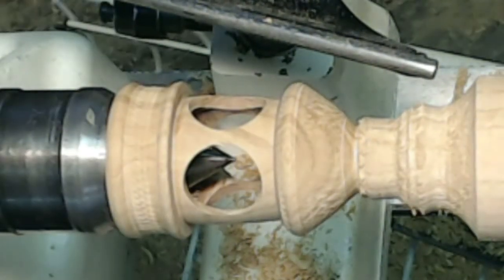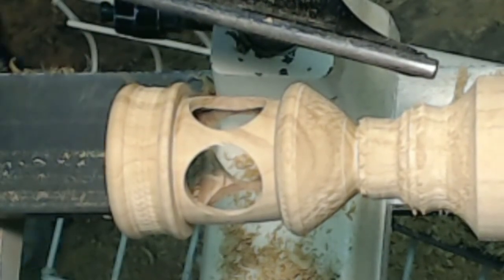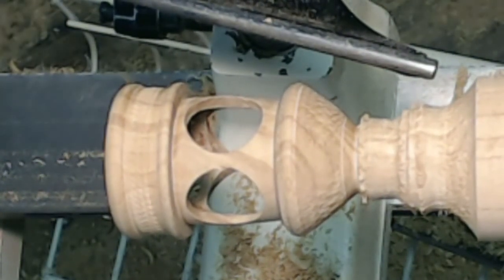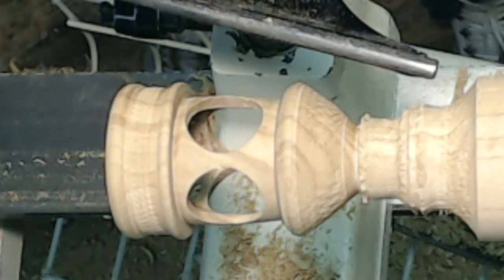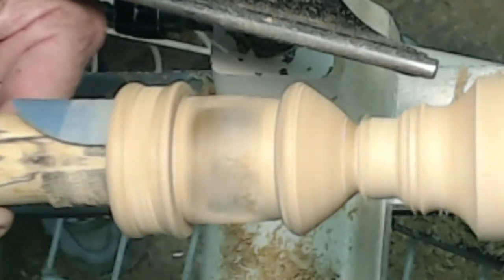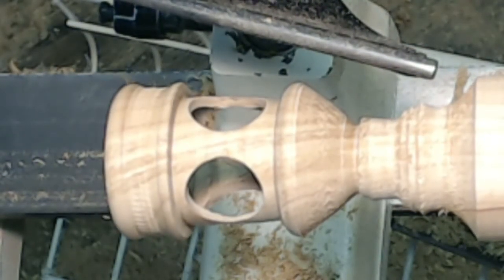If you want to sand the inside, I don't recommend sticking your fingers in there. It wants to grab you. You could get by with a little bit. What I do is I take my little 2-inch discs. This has got Velcro glued to it. Sometimes I actually cut them with the scissors so it wraps around better. But you can go in there and kind of sand a little bit. Doesn't need it much. The other tool that I use that I hope I brought with me, yeah, there it is.